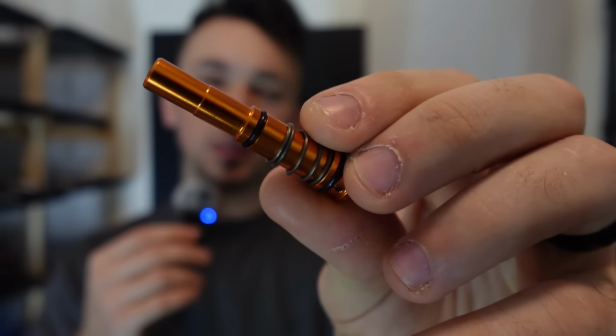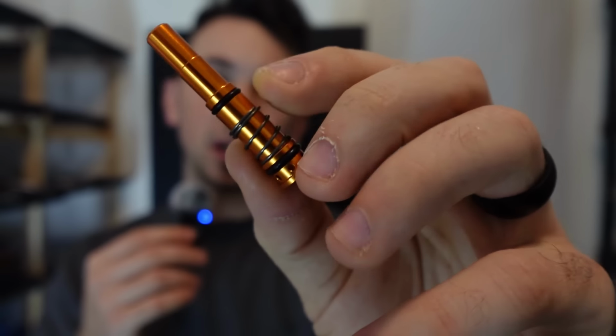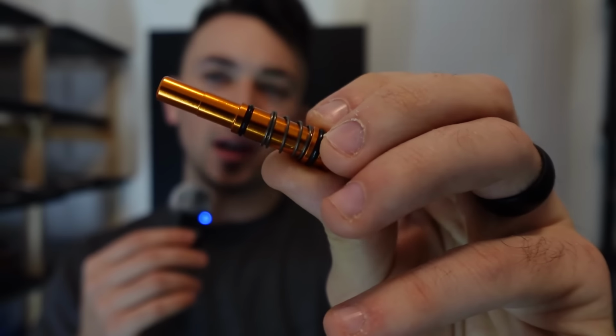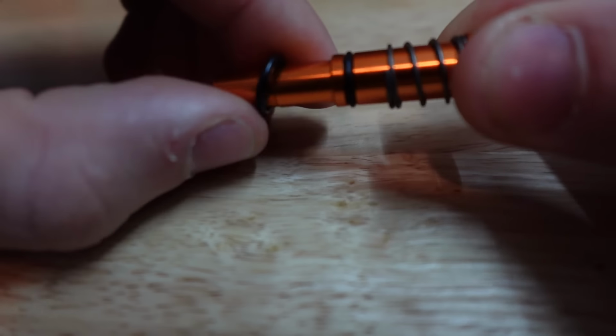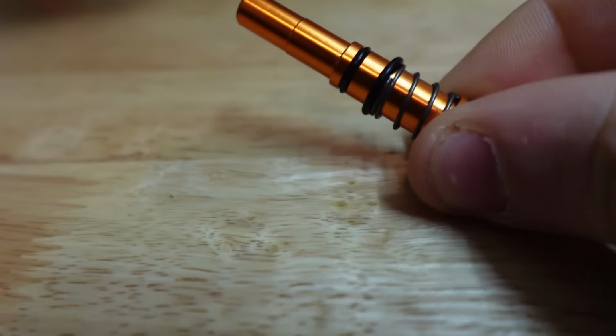The spring on the nozzle is free floating, and in each shot it compresses the spring between the nozzle and the pressure cap. This is a pretty mild impact, but after hundreds of thousands of rounds, it had slowly deformed the pressure cap until it crimped around the nozzle, making it immobile. Obviously, that's not good. I didn't have a good solution for this. All I had to do was add one more O-ring to act as a buffer between the spring and the pressure cap, so now they don't even make contact at all.